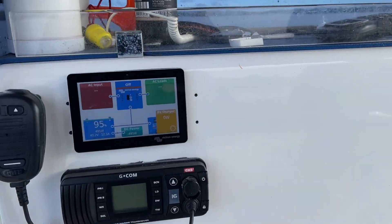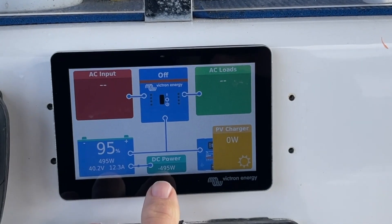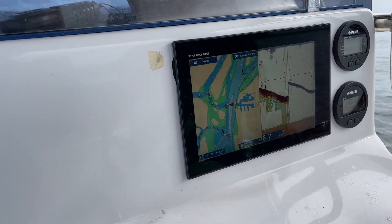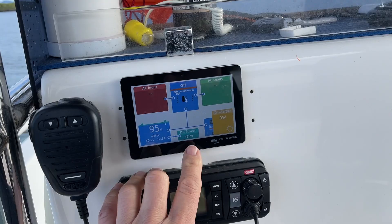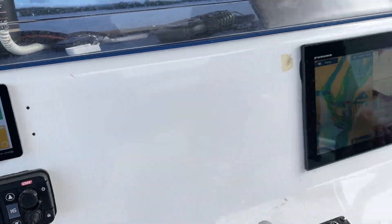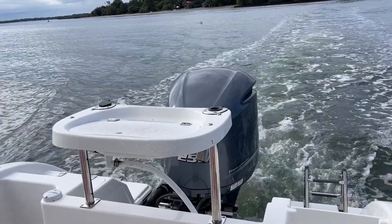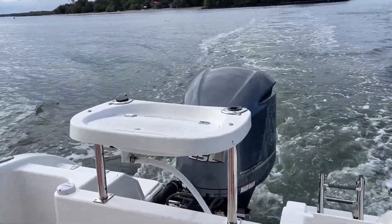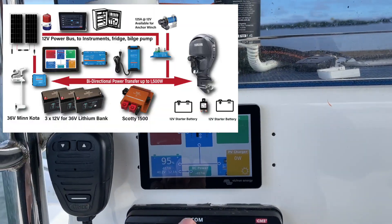Back into our landing place. We're still doing 495 watts — at what speed are we running? About 1600 RPM. We're still pulling 500 watts out of the alternator on the Yamaha 250, and that's pretty normal. They ramp up pretty quickly and then they stay there — they just flat-line in terms of the performance coming out.